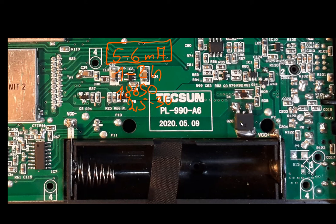First, let's have a look at what components are involved in the power path of the 18650. First, we have a Schottky diode. This Schottky diode has a forward voltage drop of about 0.2 volts. And we have a P-channel MOSFET. And we also have a USB power input, which goes to the Schottky diode. In normal operation, the P-channel MOSFET is switched on, so the power from the battery is delivered to the radio.